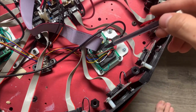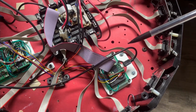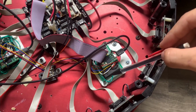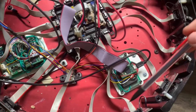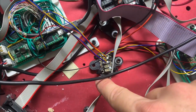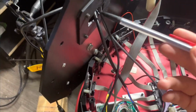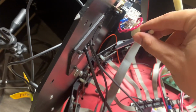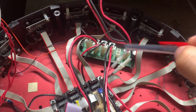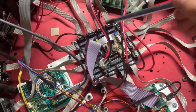This new board is responsible for driving the sonar signals. It's pretty much only connected to the sonar board, and this chip is an I/O expander that I'm essentially just using as a solid state relay. These two are connected through this little I2C hub. So one connection per microcontroller, and the third one goes up and out to the ESP. Those are the power lines for the ESP, that red and black one, going over to this 12 volt power distribution. That just comes from the 12 volt battery, also going down through the slip ring underneath this central board.